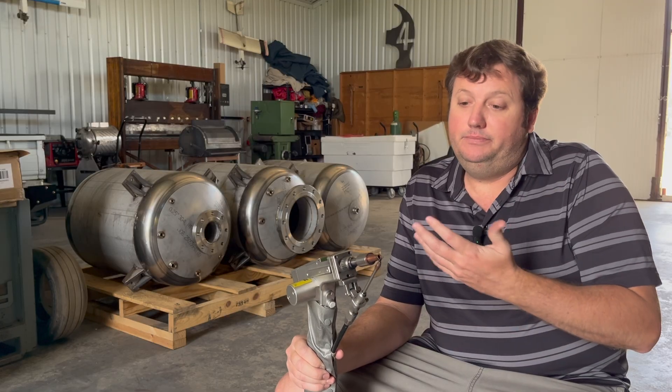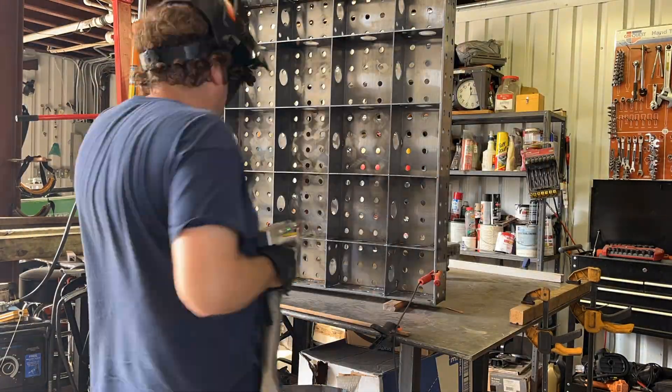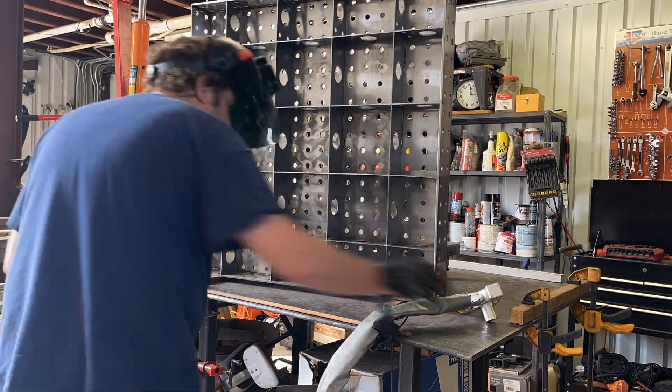The fatigue level, other than the weight of the gun, is a whole lot less than TIG. There's less heat — I'm literally wearing a t-shirt and shorts welding with this, whereas with TIG or any arc welding process you have to be suited up pretty well.